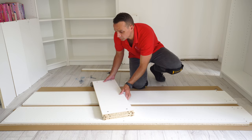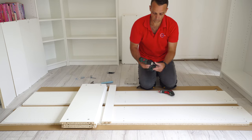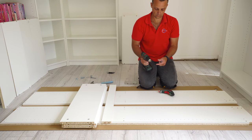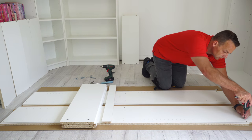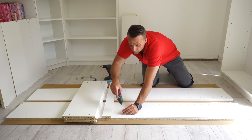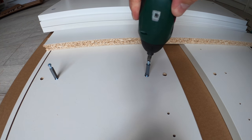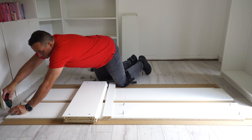Once you have two plastic locks on each side, you can start with the screws. Useful tools: a bigger electric screwdriver, a combination screwdriver and drill with adjustable torque, and a small screwdriver for smaller screws. Links for the tools are in the description. Insert the two screws with the stopper — go just until the stopper, not deeper or higher, otherwise you'll have a problem locking the screws. We'll have two screws on the top, two on the middle, and two on the bottom.